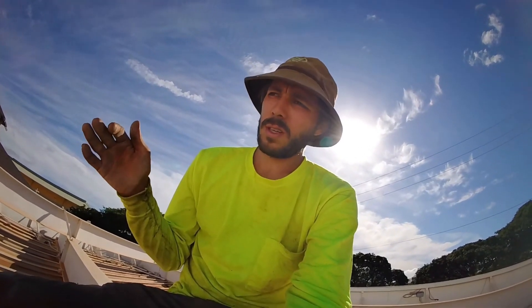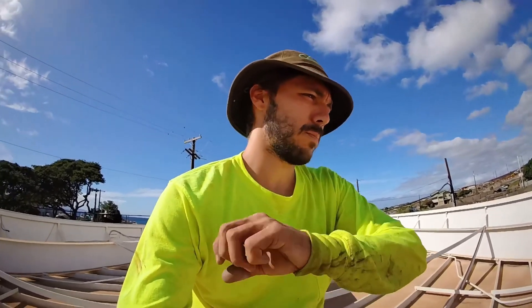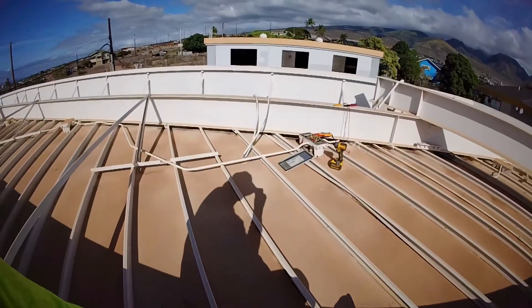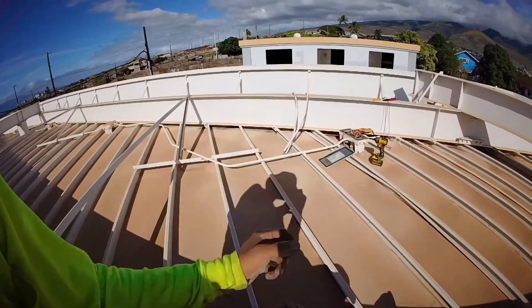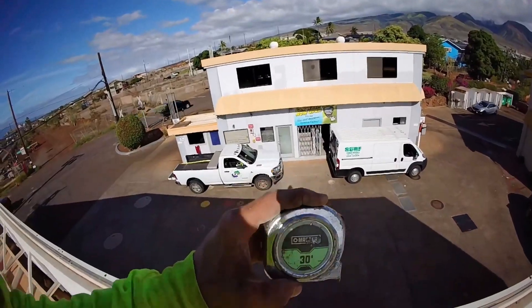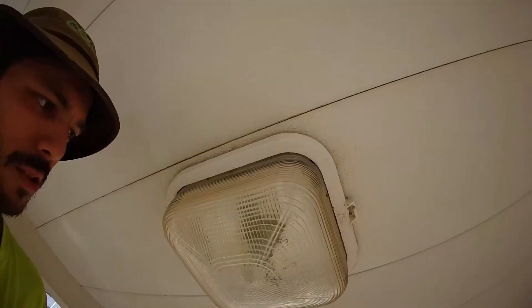Better yet, to kill more birds with one stone — the bulbs and the transformers all need to go. They're old, they're using poor outdated wiring methods, and I've switched one of these out before that was exploded. I know where to get the LED equivalents. The best thing to do is just go LED everywhere, and if there's still one not working you can troubleshoot from there. I'm going to cover this one up and take some pictures of the lighting assembly.